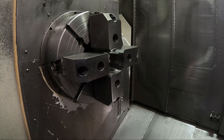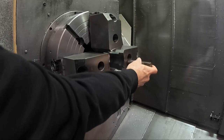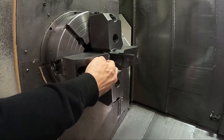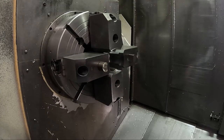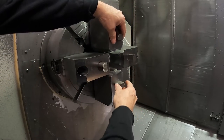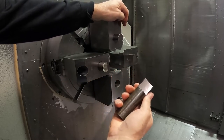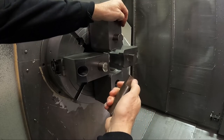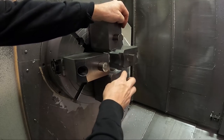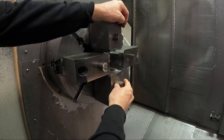This is what I do when I need to do this - I put these rods. These are just some pieces of bar stock that happen to fit the chuck jaws here in the hole, and I stick them in here. I've turned some radii or flat radius things on one side of these, but you can actually just use them straight like this as well. This gives you a little bit of adjustment for different sizes.